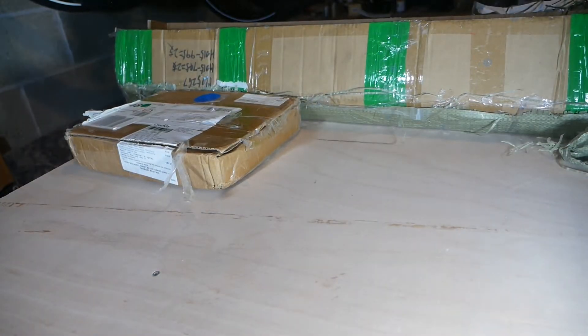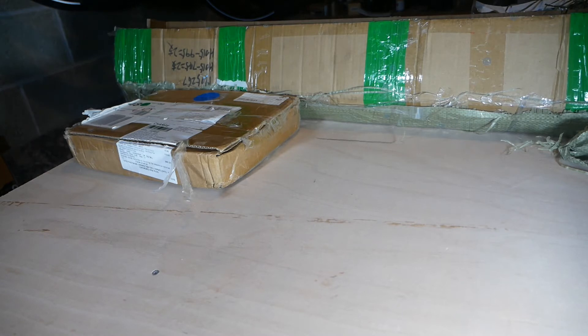Moving forward, the rails themselves were actually well wrapped up with some foam so they wouldn't take any damage. I can't do a more detailed inspection until I come to actually make it. The screws for the HGH rails are M4 cap head 14mm - they're slightly more awkward to get hold of. I've got them on order; they should have arrived yesterday, but Royal Mail has succeeded in not reaching their targets again.